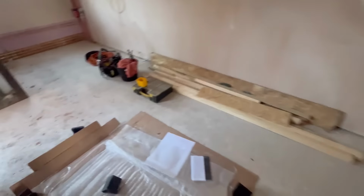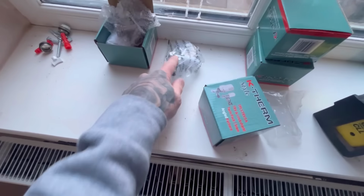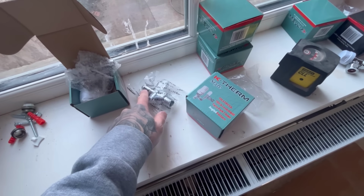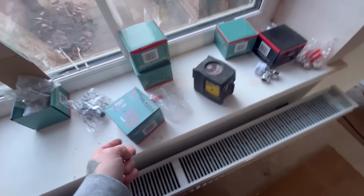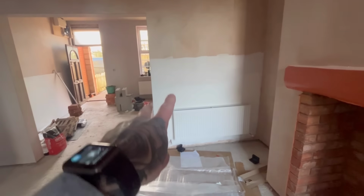And these are going to have just some M-feed elbows, straight up in intervals. I told him to get lockshield drain offs. That only looks like one to me, for God's sake. All these drops should have drain offs on, because they're all pipes dropping down the wall.